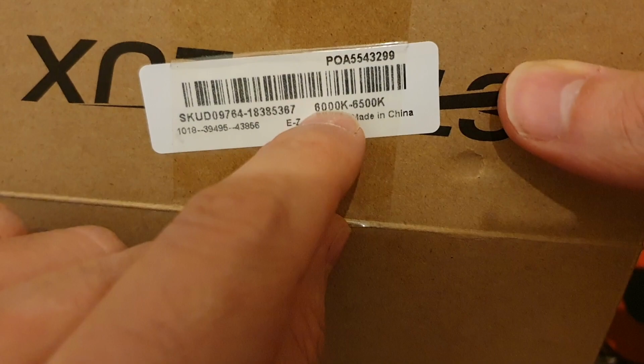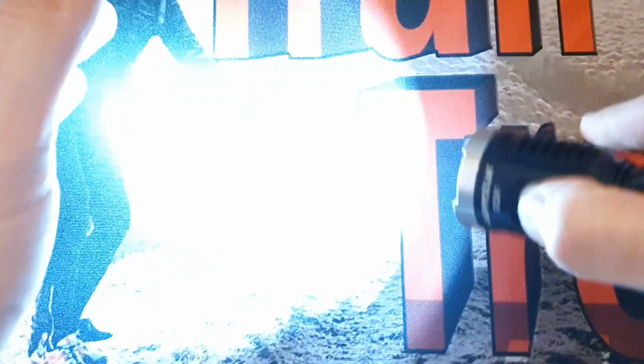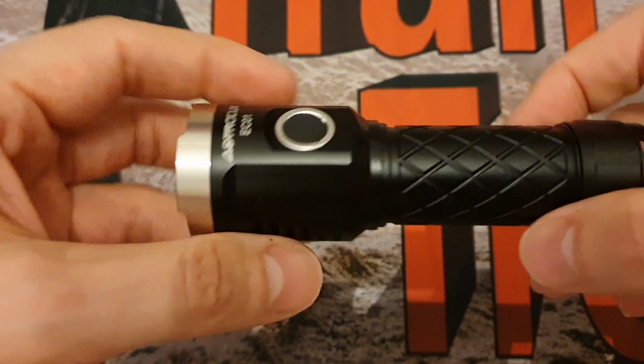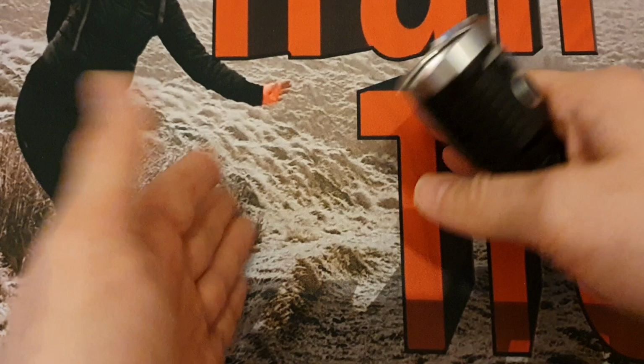I don't know, but what they're saying is this is a cool white, meaning that the light that comes out of it is rather on the cool side. In other words, like a cool overcast day. The other end of the spectrum, as you get lower in the Kelvin values, so 4,000 to 5,000, 4,500K, which I generally prefer, is a warmer, more neutral light. And by neutral, I mean it's closer to sunlight, what you get on a sunny day. It's certainly not bright white, like you would see on a fluorescent tube or something like that. It's generally a lot nicer.